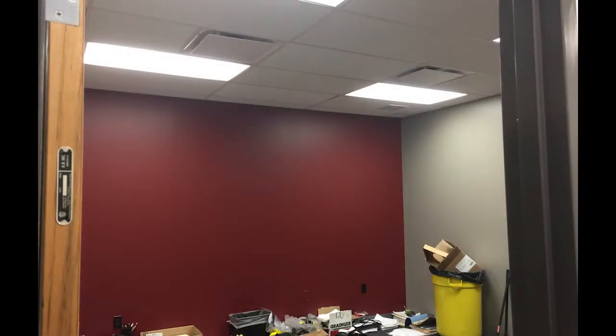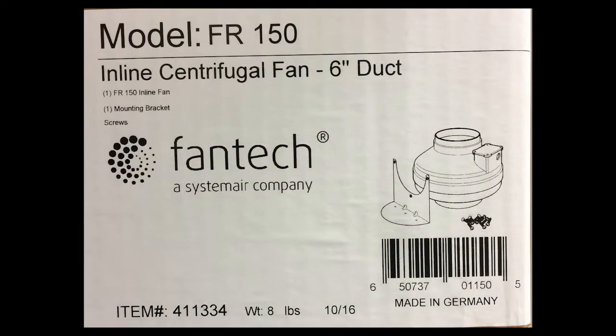The project is our school's growing and we have about four larger classrooms and we needed a fifth. We had a small room — it used to be a teacher's lounge with desks and things like that, but no one really used it. So we're turning it into a classroom. I had to add a diffuser, and since there's going to be a projector in here, I needed to add an exhaust fan to get rid of the heat. It's probably about 15 by 15 and the heat added by the projector is pretty significant. I put in a little fan to draw that heat out, ran the electric circuit, put a wall-mounted speed controller on the wall, mounted an inline fan up in the ceiling, and then vented it into the plenum above another room. So pulling the air from this room and ejecting it above the ceiling in another room.